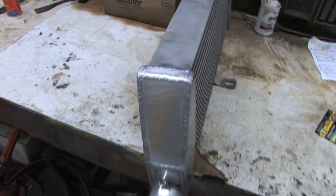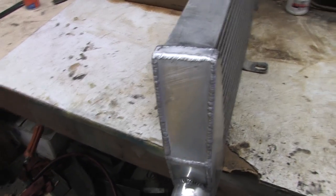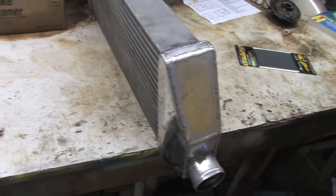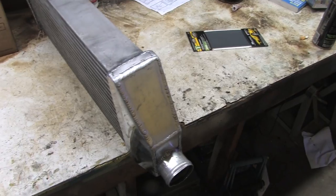The reason I'm holding this is because I got my intercooler welded back together — my buddy Andy and his Synchrowave 180 ran a couple beads around a new plate and put a new piece of aluminum on it. I cut a piece of 16 gauge out of there, which this thing was originally made from, and we fabricated an 8 gauge plate to go over it. I've had to do that on the front and the back of the end tank already on a previous occasion, on both sides.